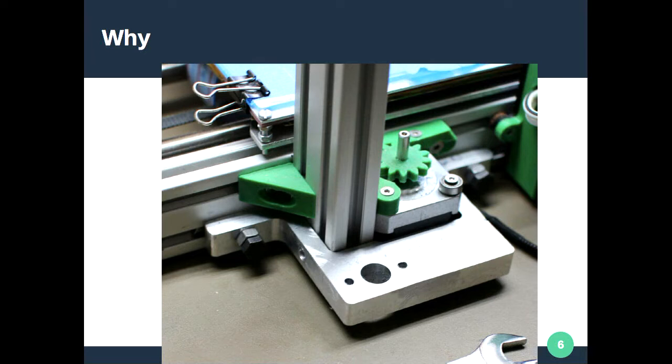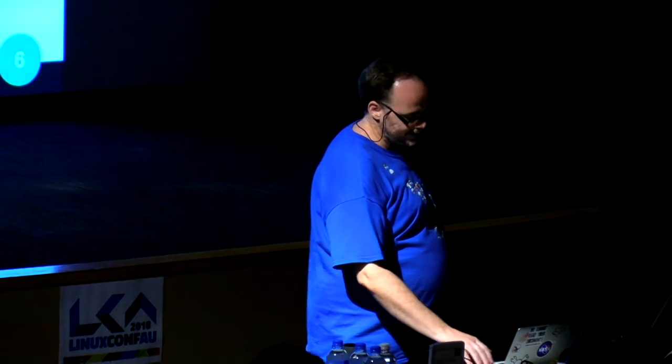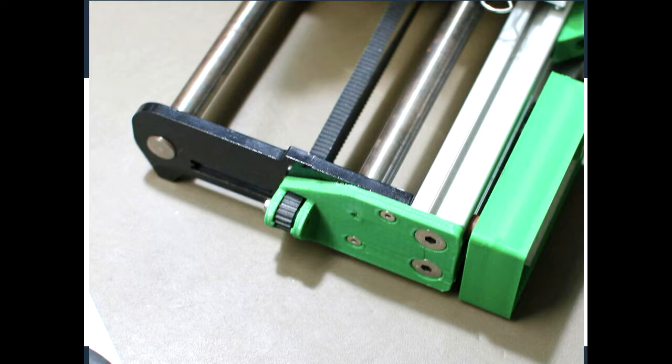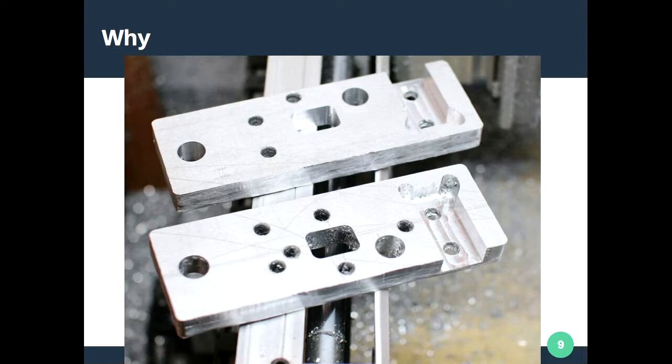You're learning CNC and CAD-CAM, and on the other side you're getting the 3D printer to a state where you switch it on and its calibration is exactly where it was before. Having done the first bracket, I decided to replace the top piece of plastic too. A lot of 3D printers are designed with acrylic — in this case there's a crack where the belt is going all the way through, and the PLA holding the sides was also cracked. After successfully replacing the first piece, I used half-inch aluminium again.